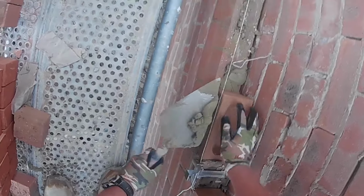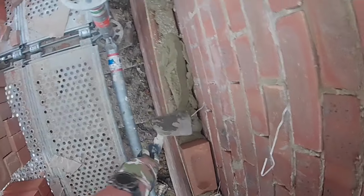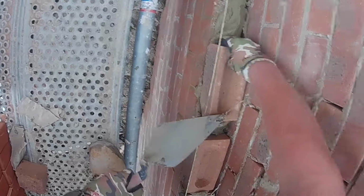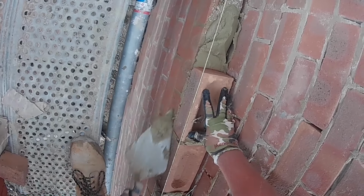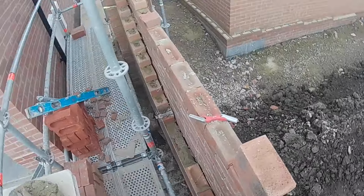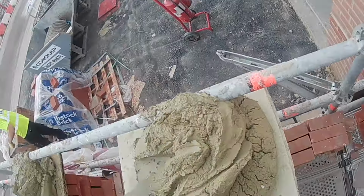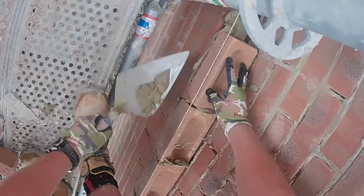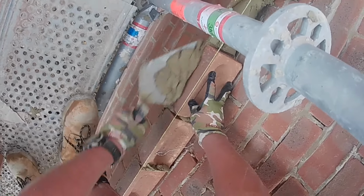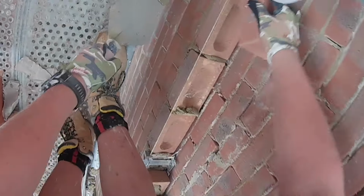And the thing is, it's all right wetting your boards up, but then you've got to stop, wet your boards up, then mix your gobbo again, and you're just wasting time. So I just like a couple of boards, pile them high, and that's it. That's one thing I'll really look forward to, when the weather's a bit wetter and the gobbo will just last a bit longer. I can just load up 5-6 boards, brim them with mortar, then you can get online and have a go, just get laying. I'll get pointing up while I'm laying away or something like that. Whatever we're going to get in practicing, it's just going to be easier when we can just get the boards filled.